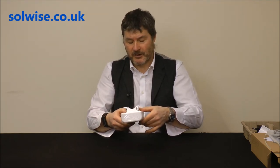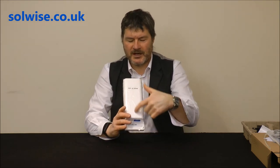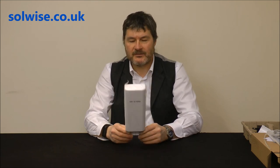So that's the AP615 from IPCOM — a 2.4GHz outdoor 802.11n product with a semi-directional antenna setup. It can be used as an access point to cover a predefined area or as a bridging device. My honest opinion is I'm not a big fan of using 2.4GHz for outdoor bridging nowadays — better to go for 5GHz outdoor bridging for a bit of extra performance, stability, and speed. But it could work if you just wanted a really low-cost bridging device.